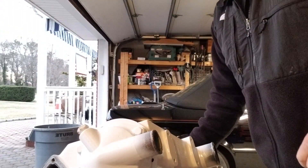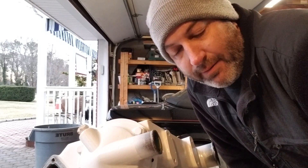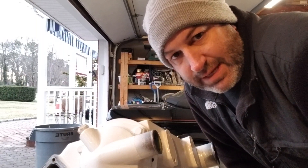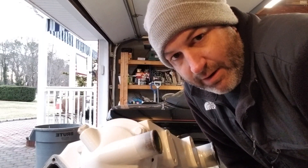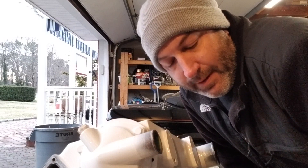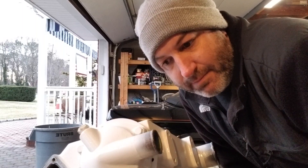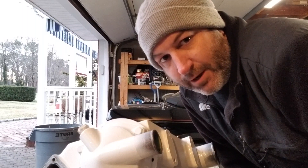That looks good through there. The same rules apply — if you can hold a little air, you can hold a little water. 20 pounds — I wouldn't recommend going above that. Even 10 or 15 is plenty. Good luck, and don't forget to take care of your aftercoolers. They're the most important part of your turbo diesel's intake system — the lifeblood. If they leak and push raw water or sea water up into your intake, that's not good. I suggest doing a pressure test after you service. Good luck.